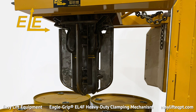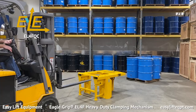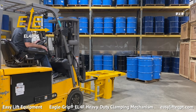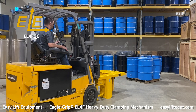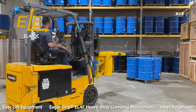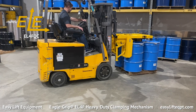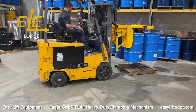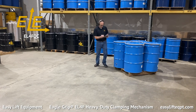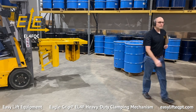The backpads are comprised of a stainless steel plate covered in white non-marking SBR rubber. The quick claw option is also available for any EL-4F model. This eliminates the need for a safety chain, as well as prevents the operator from having to dismount and re-board the lift truck to connect and disconnect a safety chain during on and off usage. The quick claw safety restraint system locks the attachment onto the lift truck's forks as soon as the EL-4F is lifted off the ground. The cam locks of the quick claw prevent the attachment from sliding off the forks when making abrupt stops, even when transporting fully loaded drums, helping prevent accidents and work-related injuries.